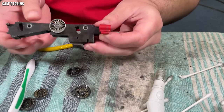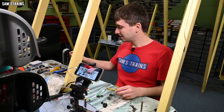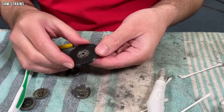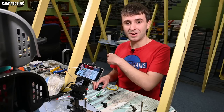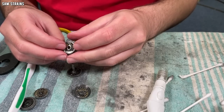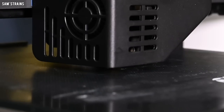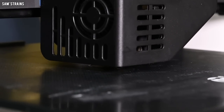And that's what I did to the axle still fitted to the loco. In part two I'm going to paint these — the way I'm going to do it is with the airbrush. I've created these holders with the 3D printer and the wheels fit into those. I'll tape the bottom of the wheel and then I'll be able to accurately paint just the section of the wheel that I want to. But before I can do that, I need to create some of those plastic insulators that I destroyed — I've got a design already but I need to print it and check whether it's going to fit into these wheels. Quite a quick turnaround for these pieces — about six minutes — and then if they do fit I can insert the little insulators back into the wheels and then paint them, hopefully getting the yellow colour on those too.